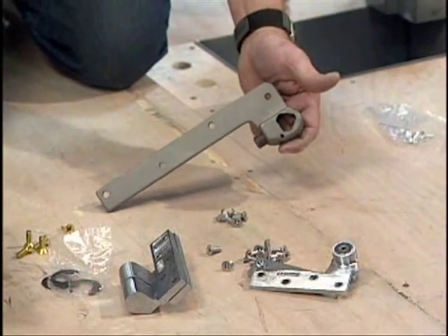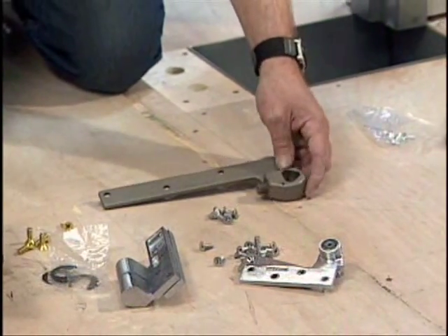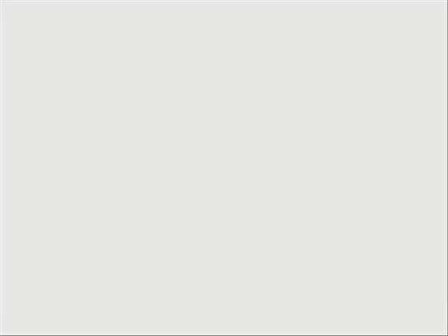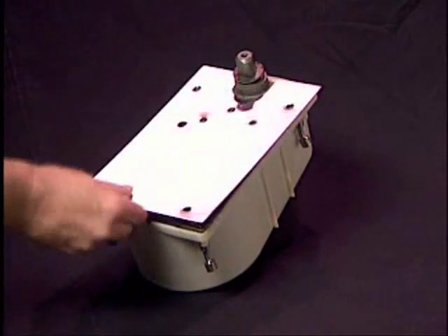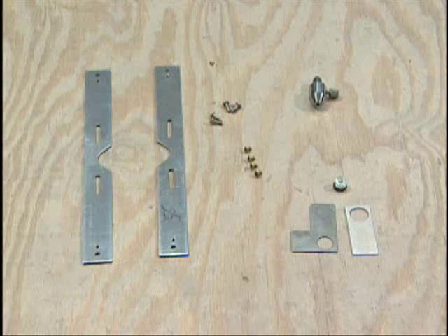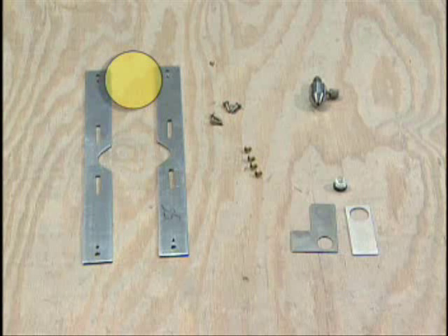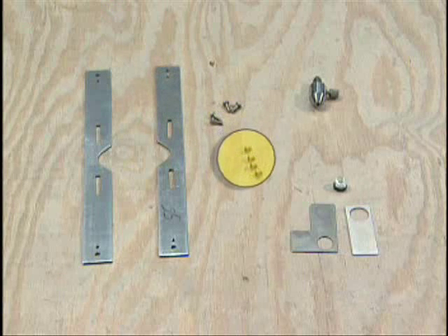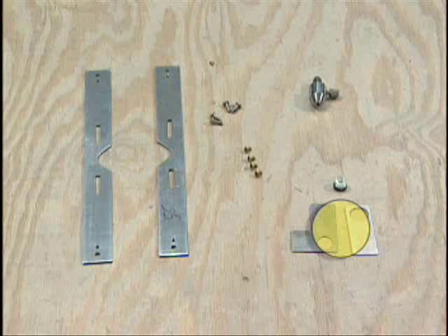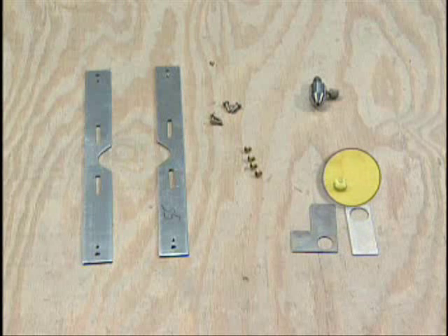Also included are a bottom arm for the underside of the door, a finished arm cap with attaching screw, and for doors without thresholds, a finished cover plate. When installing closers, no toolbox is complete without a Rixon 185 quick spotter kit, which includes metal straps for positioning the closer in the cavity, screws for attaching the straps to the closer body, spindle locator plates to properly position the closer, and a bubble level.